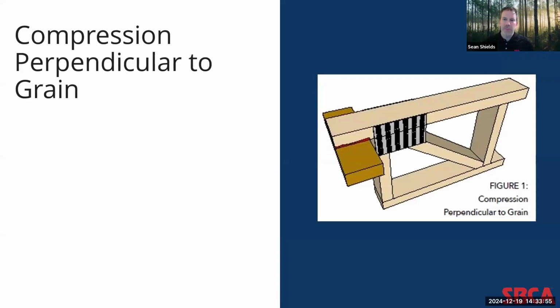So the determination of the maximum allowable reaction for an extended chord or top chord bearing truss in the latest edition of ANSI TPI 1 2022 now considers several failure modes in the design process, which again will provide greater flexibility. I'm now going to spend a few minutes quickly walking through each of those 8 failure modes. Again, for a building designer, they don't have to be specifically concerned about any one of these failure modes, but it's important to understand why these failure modes are looked at, and again, how they introduce flexibility into the design of these trusses, which again give building designers greater flexibility.